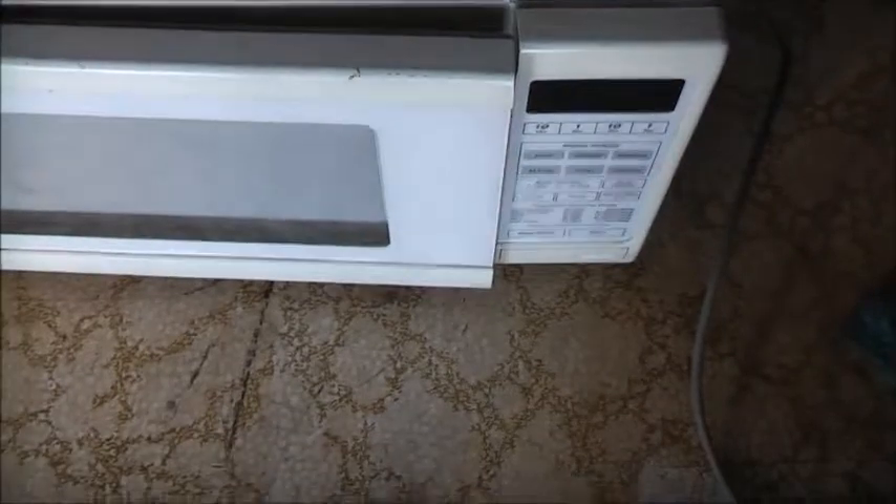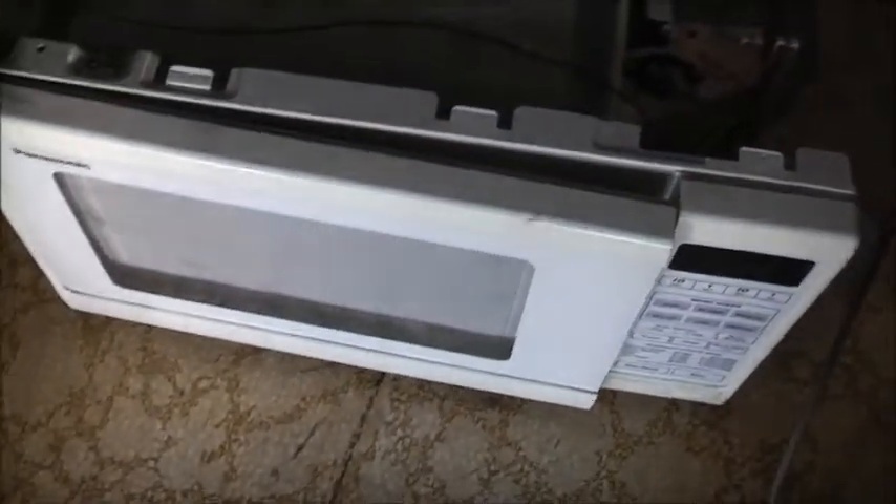OK, good day. My conclusion is I think this microwave is definitely dead. I did some tests and sure enough, I don't even hear the magnetron try to warm up anymore. I just hear the fan and that's it. I don't hear anything else, so the magnetron is dead.